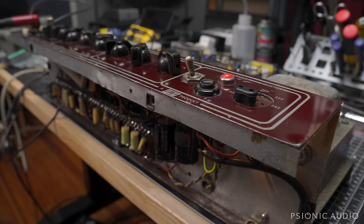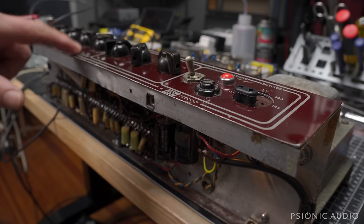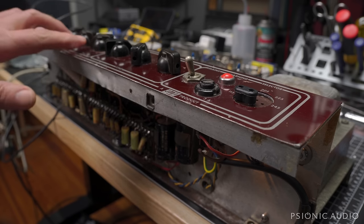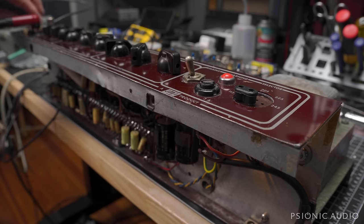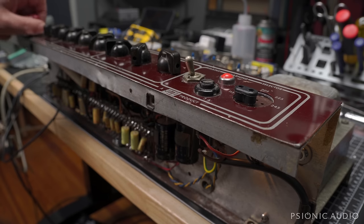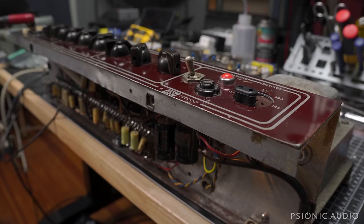Channels are out of phase with each other, but they have so much different frequency information that this really turns into your treble and upper mid-range volume, and this turns into your bass volume. As you turn them up together, the lower mids kind of cancel out in very nice ways that are friendly to ears that are used to Fenders. So it's a nice trick to do with the JMIs and the TBXs, and I can make that happen on the Custom Classic, the Custom, and the Handwired, though it's trickier to do on the Custom Classic and the Custom.